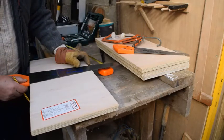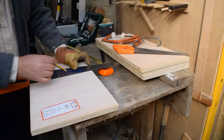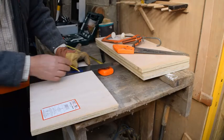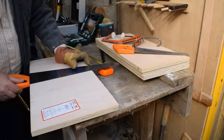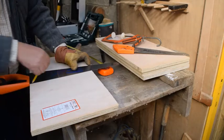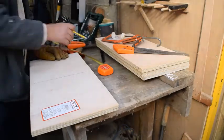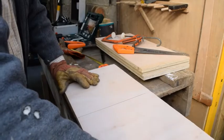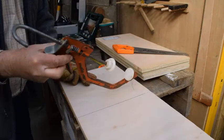Make sure you've got a good square machine-cut side, and then if you put that — line that up with your marks — and just rock it around slightly, hopefully you'll get it in the right position, and your marks show that you've got it absolutely at 90 degrees. So we mark it across with our pencil. And to make it easier when you're working on your own, as most of us do, we use what we call a solo clamp.